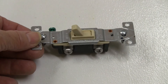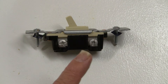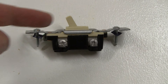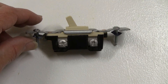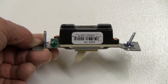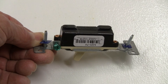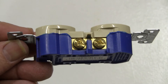This is what a standard SPST single pole single throw switch looks like — you've got two contacts here, and inside the switch is a pole that makes contact, just like we saw on the knife switch. You throw the switch, turn it on, and electricity flows through the switch. A double pole single throw switch has a set of contacts on the other side — two poles inside that can control two different circuits. On a DPST you'd have those two screws on the other side.